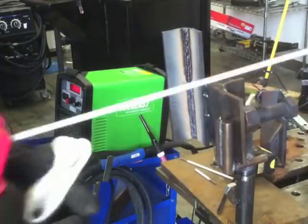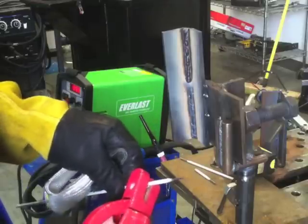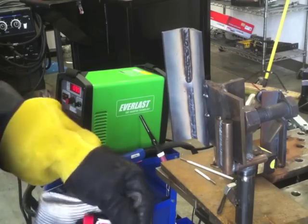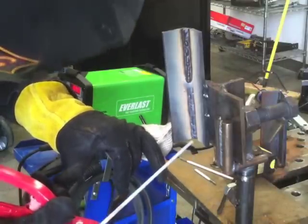That's one pass in there. I'm going to come across with a little weave pass. That piece is pretty hot now, so I'm going to show you another technique that I use sometimes. You know, I sell a product called a TIG finger — sometimes I use it for stick welding too. Just got to be careful not to get the arc right up next to it. This is a little pinky-to-thumb collapse technique, and it gives me a way to prop when there is no way to prop. For the second pass, again, tight arc. Hold those corners — it's just about a one-second affair here, a 1-2-3-4 rhythm. You want the heat hot enough to where that puddle just starts to cool behind you. You don't want that puddle following you completely, or that means you're a little cold. If it just starts to cool, that means you can control it. Keep that arc tight and don't spend much time across the middle.